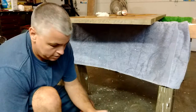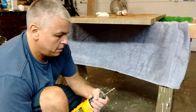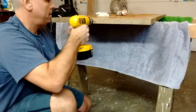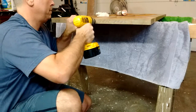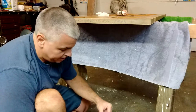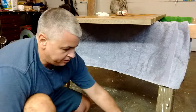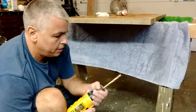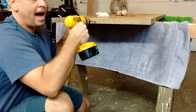Grab the drill. Put a little hole there. Like that. And then I'm using half inch lag bolts. I wanted to use the biggest ones I could so that A, I wouldn't break them off, and B, so that they wouldn't tend to bend while they're holding up these doors. These doors are 50 pounds probably. So I use a big lag bolt. I'm using a 3/8 drill and just drilling a nice fat 3-inch deep hole in there.